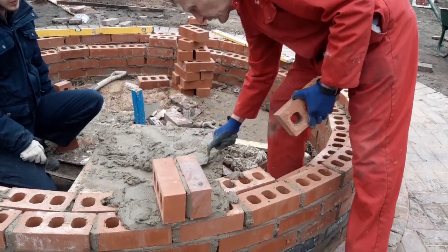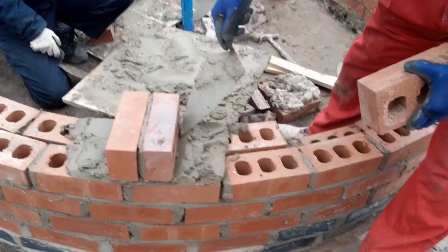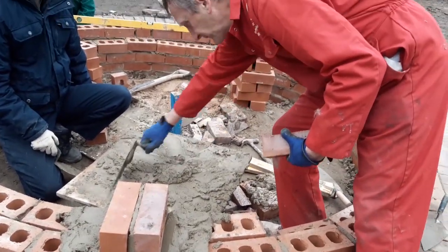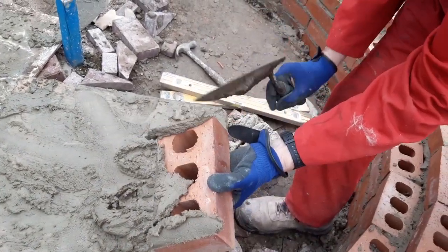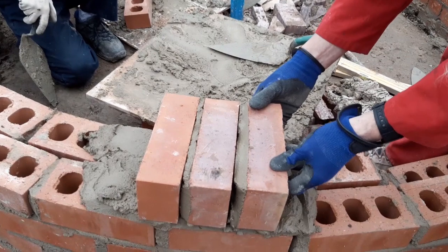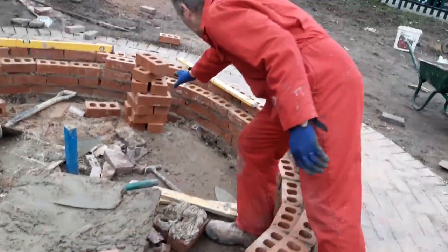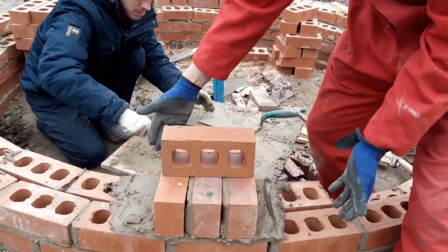The other way of buttering the brick — I'll put a little bit more in there to give us a bit more room, then just run the trowel along there to keep the gap correct; otherwise it pushes away. The other way is to get a good batch of mortar on your trowel, run it down the side, run it there, and run it down the back. Do that again, a little bit more, and then you've got your joint all nice and ready. The way these bricks work on a curve, you're roughly about three bricks to a course when doing brick on edge. I'm going to get my trammel and we'll see how that goes.